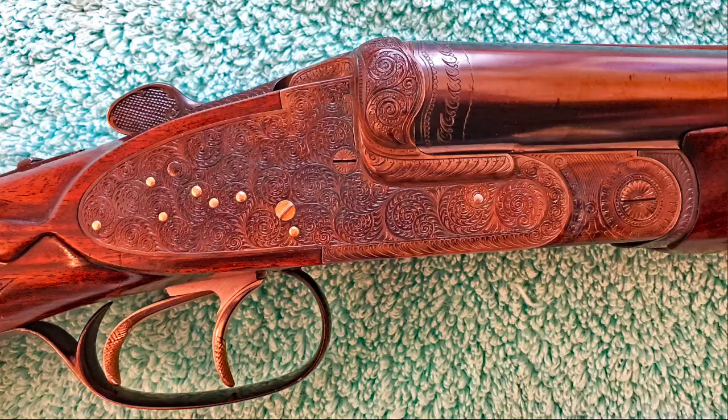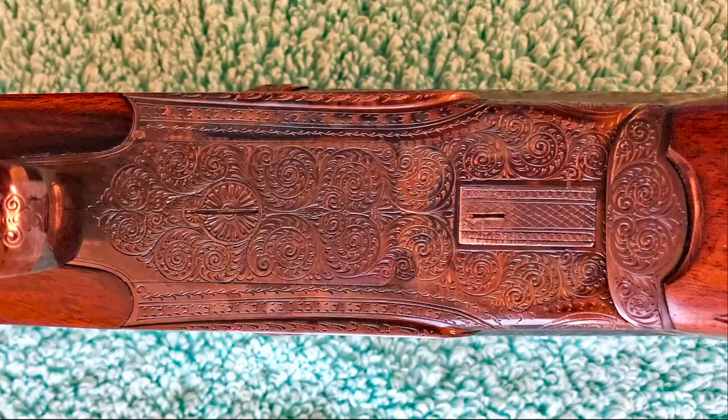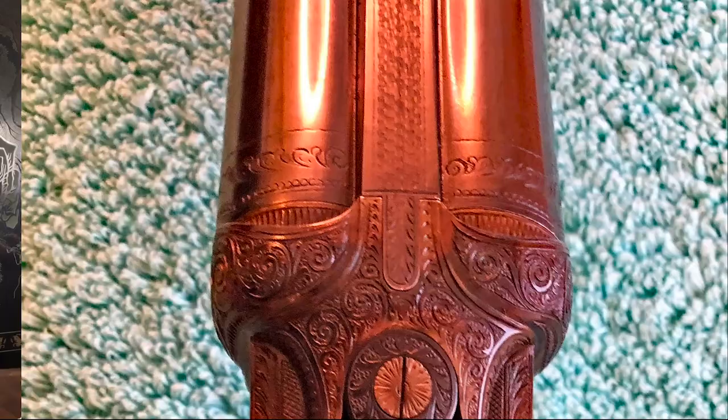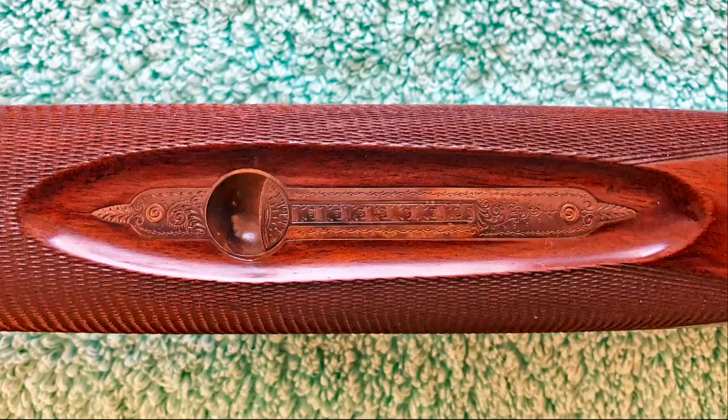Let's turn our focus to its features. This fits in the Special Gun Series because it's a side-lock double-barreled rifle instead of a box-lock, and it's handmade. Being a side-lock double-barreled rifle, it has two locks, each one mechanically controlling one trigger, one sear, one striker, and one barrel — each independent of the other, and mounted on opposite sides of the receiver. The action components are finished with colored case hardening — this is the finish of the locks, the top and bottom of the receiver, the top tang, the top action lever, and the forearm escutcheon with the Anson and Dealey release.